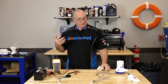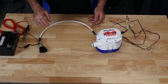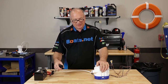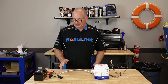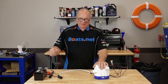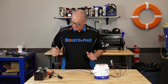Next we're going to bring in a two-way switch with a setup where it's actually an automatic bilge pump, meaning the switch is on the inside of the pump. This one is a little bit simpler and operates a little bit differently — it uses just a regular on-off switch to trigger it in manual mode. This particular switch is a rocker type; I would probably suggest going to a momentary to run it manually so it would release. The way this one gets powered, it is hardwired going through the switch back to the pump so you cannot shut it off. That is great for people who may forget to put their bilge pump in the run position, especially at night when you're asleep and something goes wrong. With this system it's constant hot back to the switch, so it's ready to go.